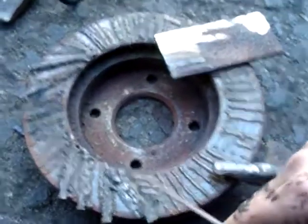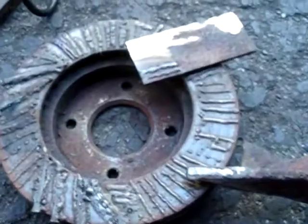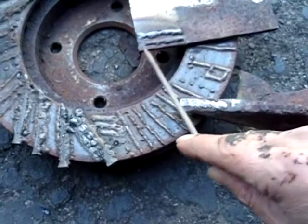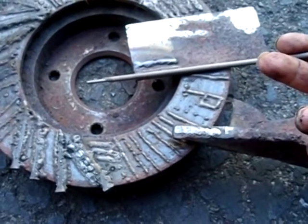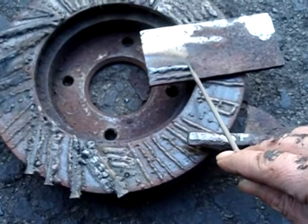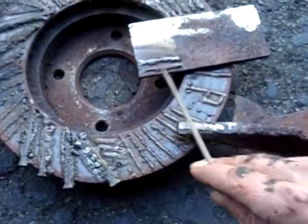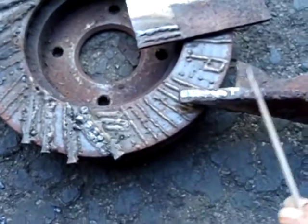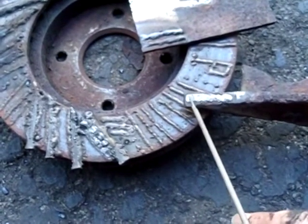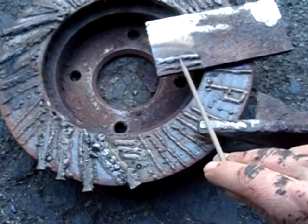But then I did stick welding and I couldn't get the nice ripples I was looking for. You can see these two passes right off the bat with a 3/32" 7014 rod — they have nice ripples on this bead. I did the same thing at 90 amps on this cast iron piece, and it's got this funky bumpy, lumpy texture to the surface compared to the nice ripples on steel.